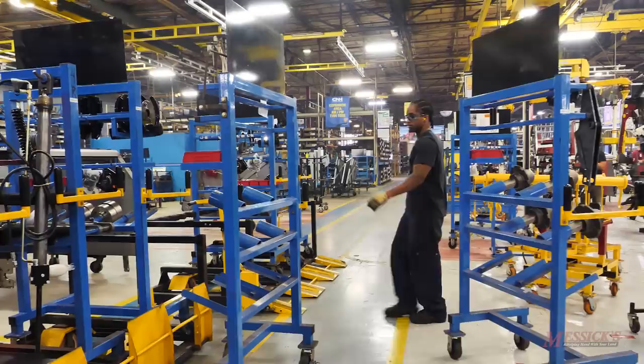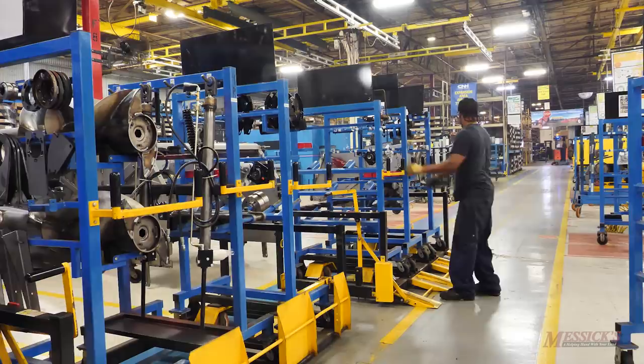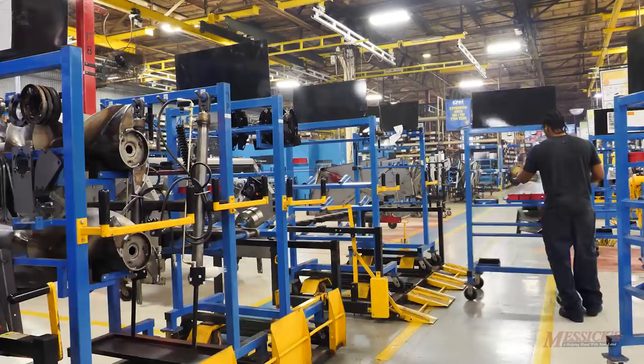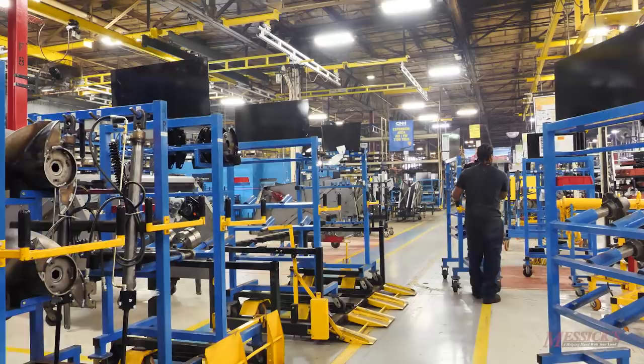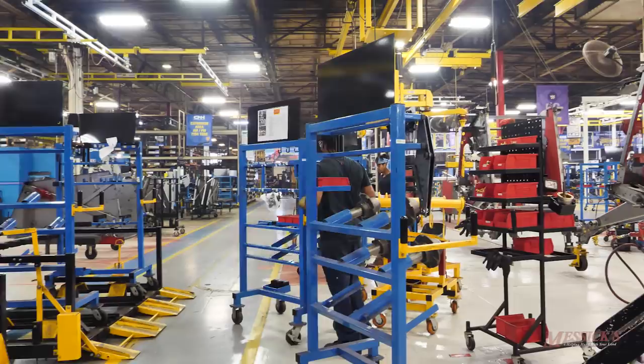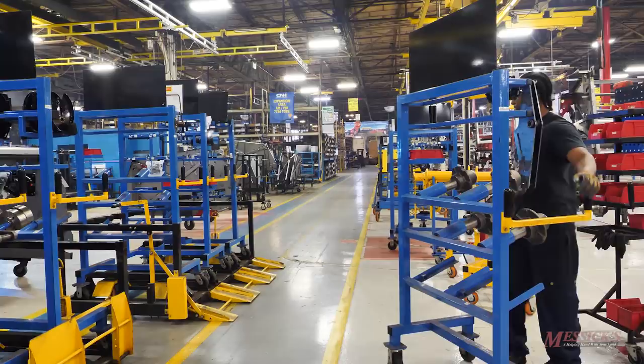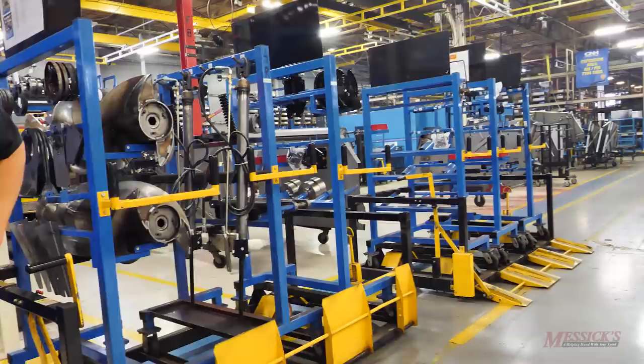With WCM (World Class Manufacturing), logistics delivers only enough inventory to the side of the line to make two components at a time — no more wooden skids piled up. Kits come from the warehouse in another building on kit carts called 'daughters' nested inside a 'mother cart' carrying three kits. All components are delivered in the 'golden zone' — between the worker's knees and shoulders. For example, wheel hubs weighing about 40 pounds are delivered right at waist-to-shoulder height, so workers never have to bend to the floor.